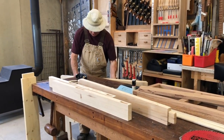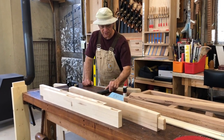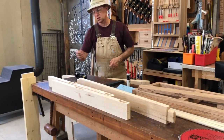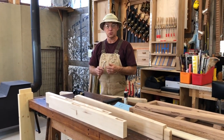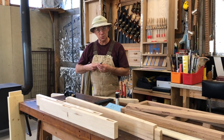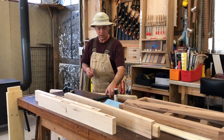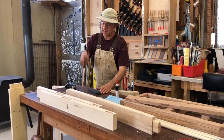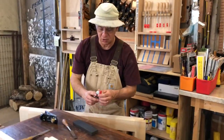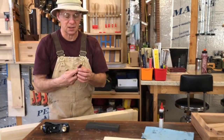No major issues so far, which is nice. You'll also see that I've got my little oilstone out here with some three-in-one oil, and I keep these chisels nice and sharp. Remember, a sharp tool is a safe tool. A dull tool is an unsafe tool — because with a dull tool you'll put more pressure on it, you can slip and catch yourself very easily. So these are just razor sharp. I'll put a few drops of oil on there and do these by hand. I'll show you a quick demonstration on sharpening.